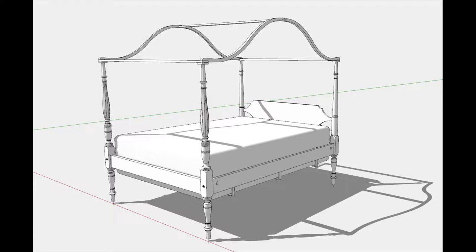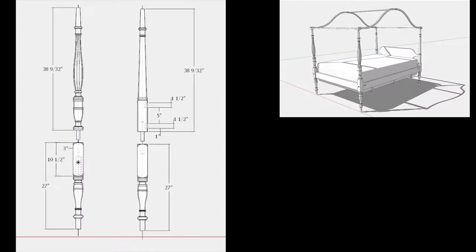I'm building this Sheraton four-poster field bed, starting with the four posts — the main components. Here is a detailed design of those posts. Notice that they're actually two pieces to fit on the lathe, and the sockets need to be drilled for a one-inch dowel.